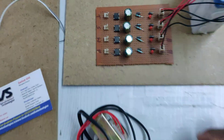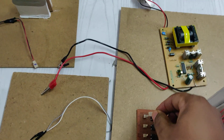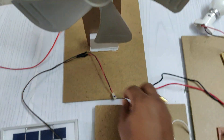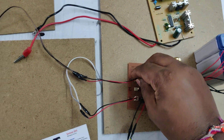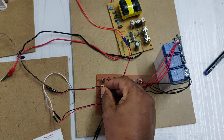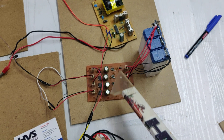The input select labels are: T for transformer, S for solar, W for wind, and P for piezo. Every source has a respective label on the charging circuit. Coming to the charging circuit station, it has three main stages: rectification, filtration, and unidirectional current flow using two diodes.